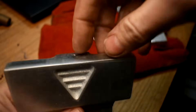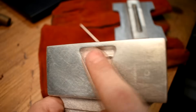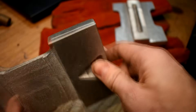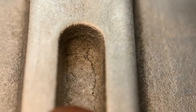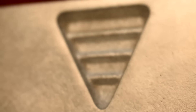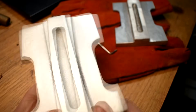I could have used a feeder right there, and I am still very convinced that my furnace is running a little hot. We got that little bit of shrinkage — it's divoted in slightly, which could have been caused by the extra heat, although I think it's mainly just a design issue. Inside this groove, right on the edge, it casts fairly nice, but that almost looks like a hot tear — a little tear in the metal. If the metal's too hot you can get hot tearing. I think you can make out another one on the other side. Again, it's not going to affect the usefulness of the part. I think the part came out really nice and you're not even going to see this part — it's completely hidden.